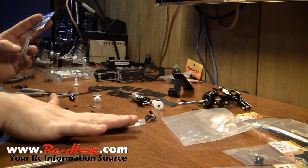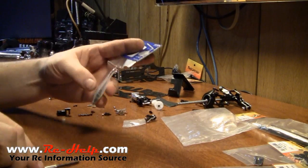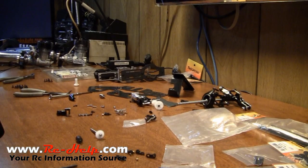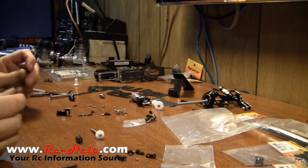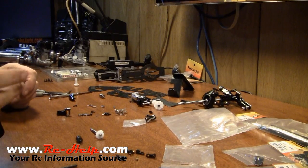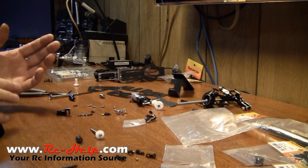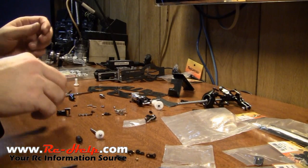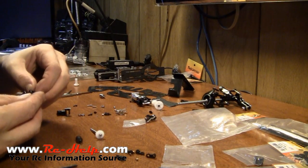Make sure not to get any of that confused with any of this. When you're building the tail back up, what you want to do is a dry fit. You want to put all this stuff together and make sure everything is spinning free. If it doesn't spin free, remove a shim, move a shim to a different location, and then try it again. That's exactly what we're going to do by installing the back bearing.